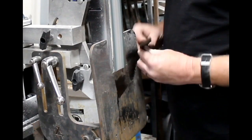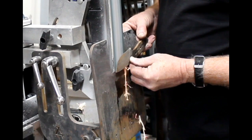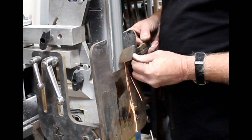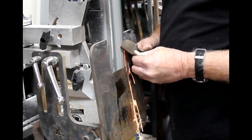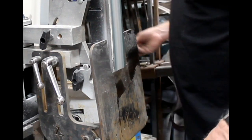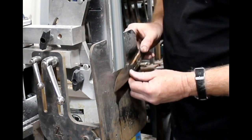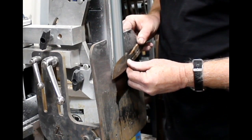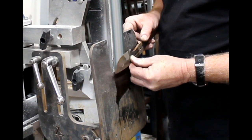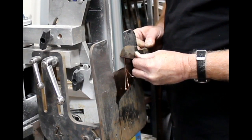Most of the sparks will actually end up going behind the tilt table, but you definitely have some sparks in the front. The main thing is keeping the knife cool — you don't want it to get too hot after heat treating, as you don't want to ruin that temper. So quench it down frequently. After finishing the bevels, that's really the hard part of making the knife.